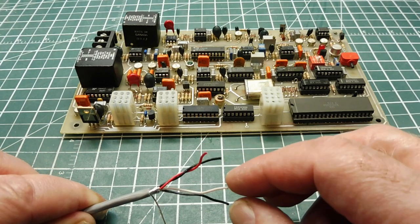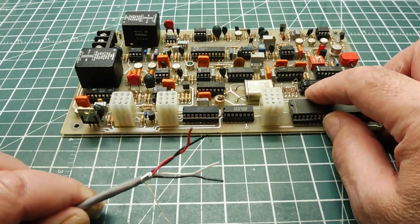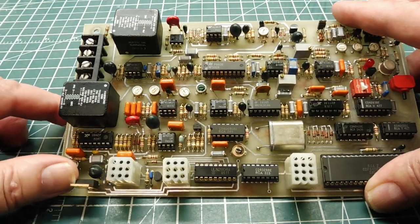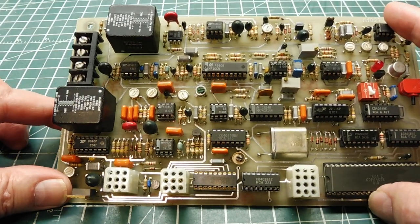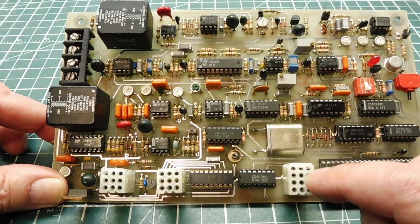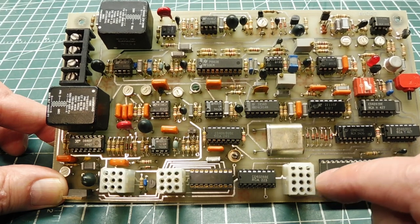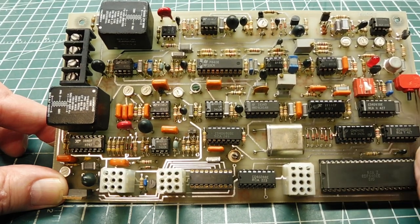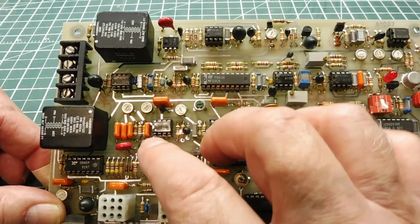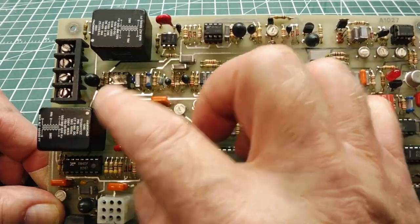These four wires — the two pairs — can be hooked up to my interface board. On this board I have interfaces for everything I can think of: UART, I2C, SPI, Dallas Semiconductor One Wire. I have inputs for switch contacts to monitor animal pen doors, Ethernet, and Bluetooth. I can monitor temperature, humidity, soil pH, and sunlight intensity. I even have legacy signaling — FSK and DTMF — using transformer 600 ohm phone lines.